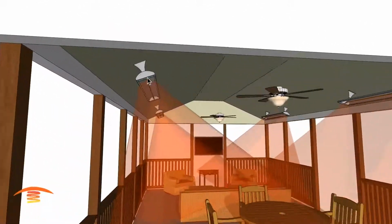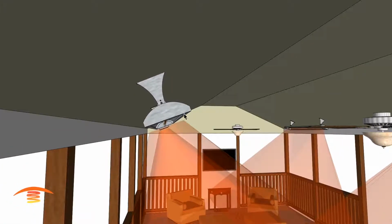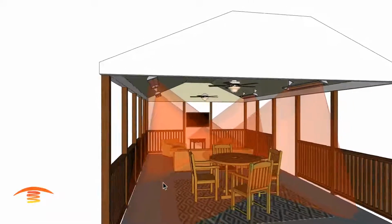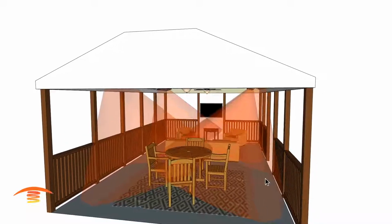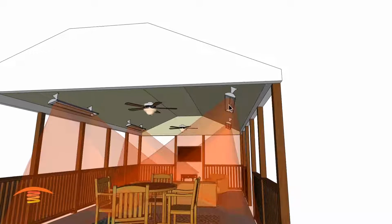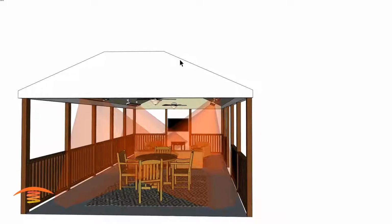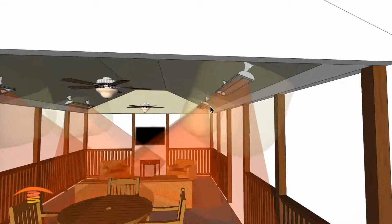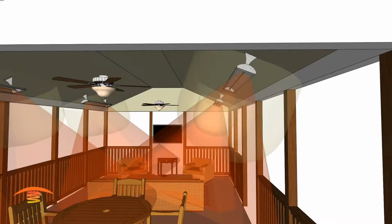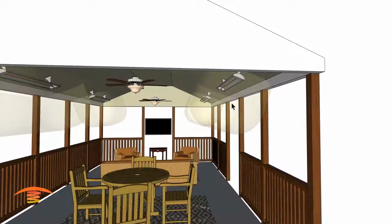I think the degree of angle I have on here is from horizontal, so if you were to place this heater pointed straight to the ground, I have this at a 15-degree angle to accomplish this coverage. You can go to a 20, and then you'd miss some of this edge here, and in this example, it's obviously fine. And if you were to move the heaters up, like I originally made a quote about, then you would want to change that angle down, so it's maybe a 10 to 5-degree angle, depending on how far up you go. But again, you want to make sure you don't get too close to where the fan blades are in this zone of clearance here. You want to make sure you're meeting all those clearances, and that's true with the 6,000 watt unit as well.